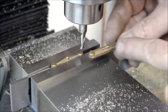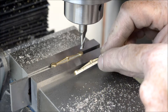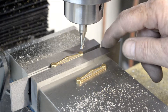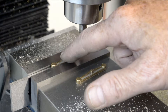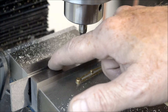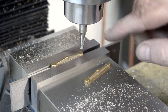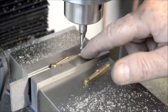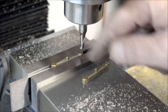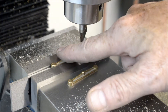Both of these crosshead caps are milled down to the proper thickness. Now I've got my end mill zeroed out on the parallel that the crosshead cap is resting on, and I'm going to spot this boss to give me a nice flat surface. This has got to be a hundred and fifty-six thousandths thick. When I get to one-fifty-six I'll stop, move it over, and spot that boss there as well. I'm just going to show the one on camera.